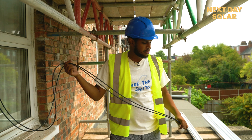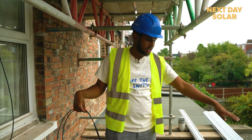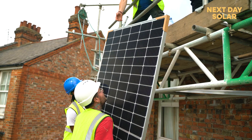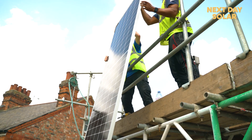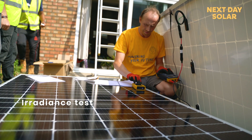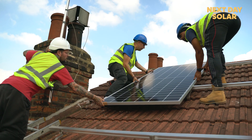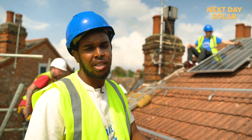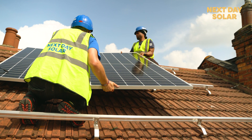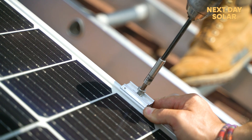This cable you see right now is the cable for the flat roof — we've already done the cable for the pitch roof, so we're going to leave a bit of slack to ensure it's enough for the solar panels. At the moment we're taking the panels from the bottom and mounting them one by one, and at the same time we're doing the irradiance test on each panel before it goes up. Then the guys get the panels on the rails and connect the MC4 connectors, doing a tug test to confirm they're not coming apart.